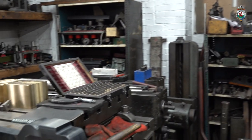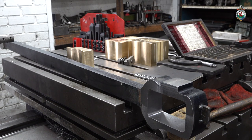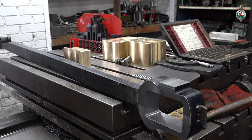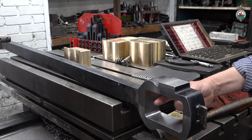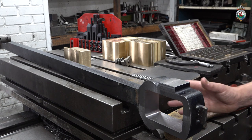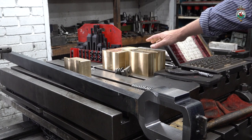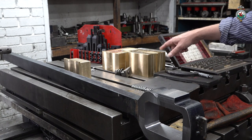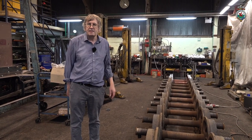In the machine shop we've got one of the Welsh Pony rods — this is a connecting rod. You can see the far end just has a small eye which will have a hole bored in it, and that will have a pin through and sit in the crosshead. At this end we've got the eye and you can see the inside has been machined out to take a rod brass. There's one of the old ones, and there's some material here that's been cut and roughed out ready to make the new brasses, marked up to show which bits they make.